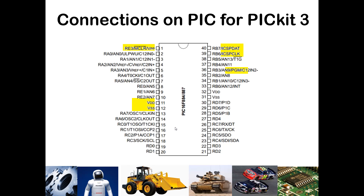If you're not careful, you could have a conflict with devices on Port B. It's good practice when using an in-circuit programmer like the PICkit 2 or PICkit 3 to disconnect whatever is attached to your RB6, RB7, and RB3 pins to avoid interference. This is often accomplished with a special jumper setting that automatically disconnects those pins during programming. Our trainer kit handles this automatically, but if you develop your own embedded systems project using the PICkit 3, you'll need to manage those disconnections yourself.